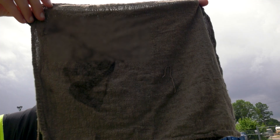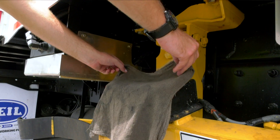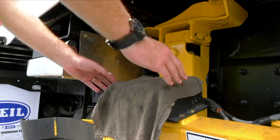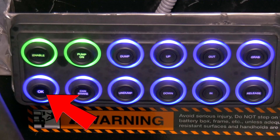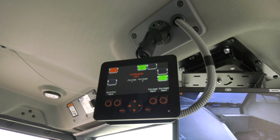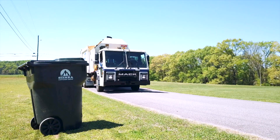Using a thick rag that you can't see light through, place it over the sensor box, completely covering the opening. You can use another similar object, just be sure that all light is blocked out from the sensor. Press OK on the manual push button controls to confirm, and then the next screen you will see is the home screen. This means you have completed the calibration.